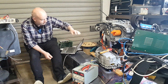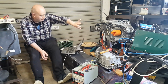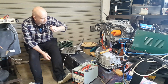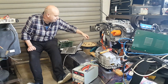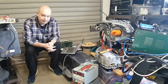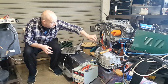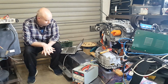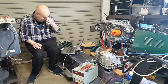Right now, I've been doing some testing with the field orientated control firmware. And while I can get the motor to hop and jerk and jump about a bit, I cannot get it to spin properly. So, I started doing some investigations here, and I did have some rather crazily stupid noise prone resolver leads here, so I got rid of those and we're now using the original Tesla resolver cables going into the Prius inverter. Got these cables here for our 3-phase power. I've got them tied together so that we don't have any loops in them, because remember folks, loops radiate. Loops bad. Unless you're making antennae, then loops good. Right. So, confusing.